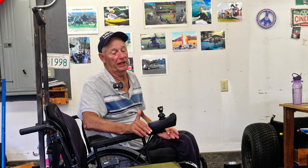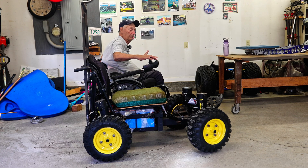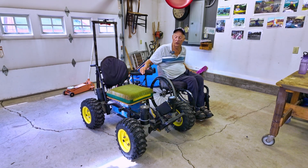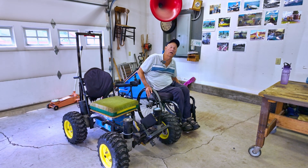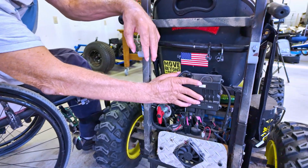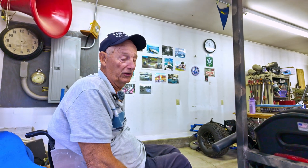Basically this machine has independent steering, so you can use the joystick to steer it forward and backwards. It also has two controllers on the back. So with four motors you're sucking up so much power you can't use just one controller. If you come here to the back, you'll see it's kind of a wiring nightmare. But this controller is for the front wheels and this controller is for the back wheels. We have just one joystick, so you have to splice a lot of wires to get it all to come together right.